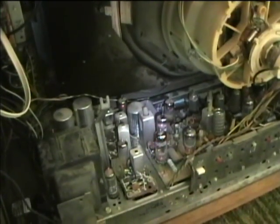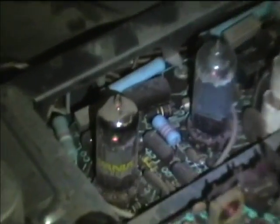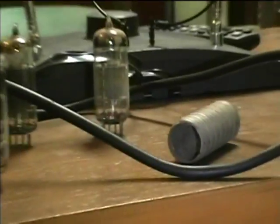You have to take the tuner apart and all that, so especially just to try it, I wired it in from the top. I think it'll be a good repair. I took the Dremel tool and ground off all the corrosion from the pins of the old coil, then soldered on the new one. The tubes replaced were the sync AGC and the 6K8, but the one that gave the biggest improvement was the first video tube.